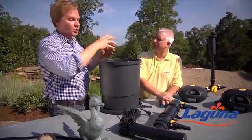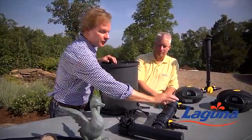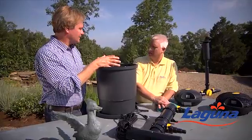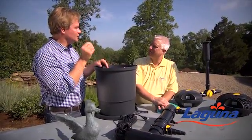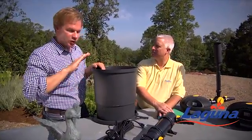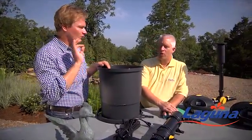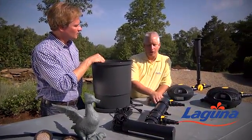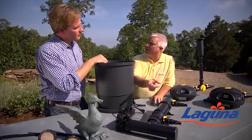Just so people understand, what happens is the water is constantly flowing through this tube and it's being bombarded with UV light. That UV light kills the algae. And so there are no chemicals involved at all — none whatsoever. The light is on all the time, and very little energy is used. Our actual unit has a helix design inside, so the water has to spiral around the bulb to give more contact time — more surface area contact time means a better kill ratio.